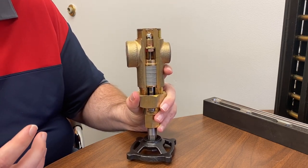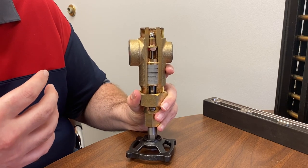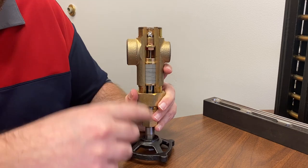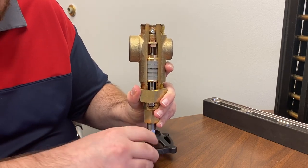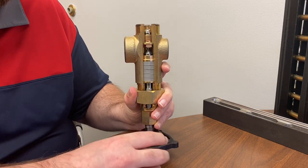Obviously during commissioning we don't want that to happen, because you want level to get into the valve. If you open the valve too far during commissioning, to reset the ball check you would have to close the valve — watch that pin move all the way up and unseat the ball check.